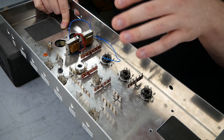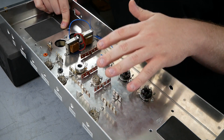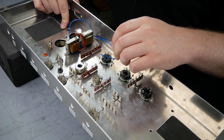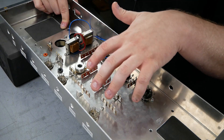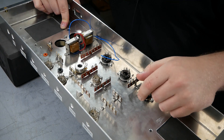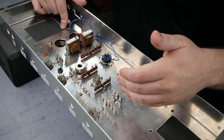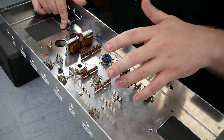A quick note on the terminal strips: I didn't show it here, but it's really as simple as either doing it very specifically in your layout so you know exactly where to put them, or just a general placement of how many terminals do I need and approximately where are they going to go. Then just come in, drill the holes, and mount the terminal strips. There's really not much to it — just make sure you have enough lugs on your terminal strips to do what you need.